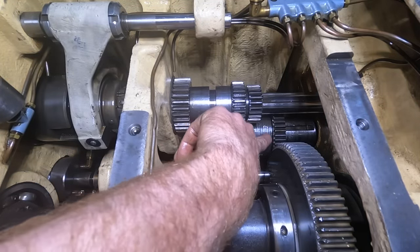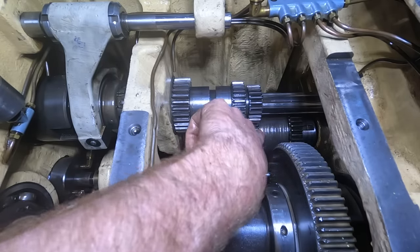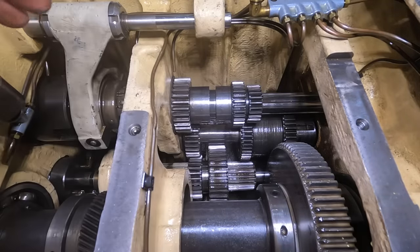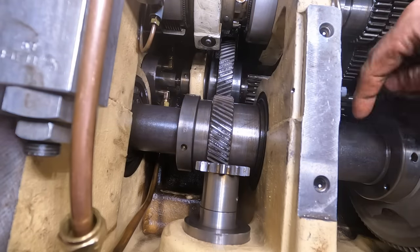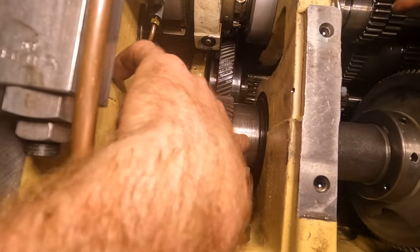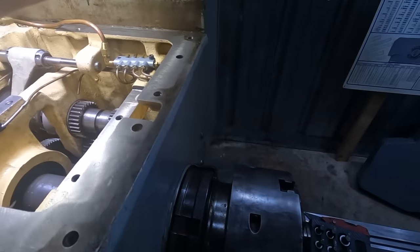And I think some of the grinding, some of the long serrated marks on that gear there, the one that came unpinned and unkeyed, I think those are just from junk getting in there and wearing. It also could be the factory finish, although looking at some of these other ones, like these right down here, I don't think that's the factory finish on that one. If you look at the factory finish on these two, it's not perfect. You do see the serrated marks of the turning tool, but it isn't as bad as that gear that came unkeyed.